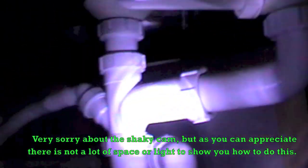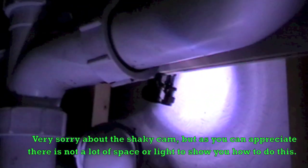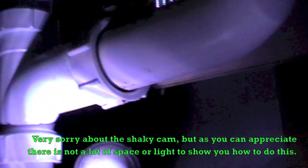That's it up there — you can just sort of see it in the camera, but not greatly. There are my flexi hoses dropping down. The flexi hoses now need to be attached here, but as you can see there's a gap — that's because the flexi hoses need to be attached to a piece of copper, leaving some flex in the hoses as well. So to these we now need to attach our copper lengths.